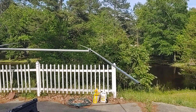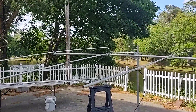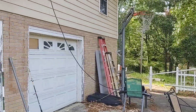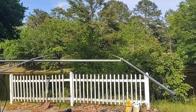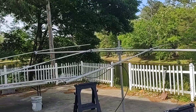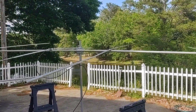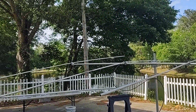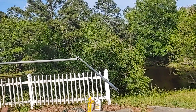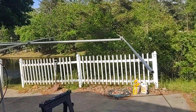So many guys were asking about the design, so I figured I'd share. I got about a 1.4 SWR on this with no matching system, and we're about five feet off the ground on a one-and-five-eighths base mast. Right now I'm pointed south — that's the second director element. When we get it up on the roof, the SWR should go down. I've been talking all over the place pointing this northeast, and folks up there are telling me I'm giving them 20–30 dB when the skip is really rolling.